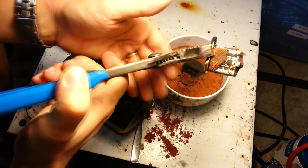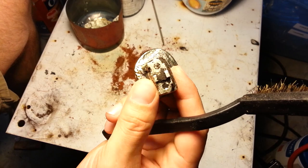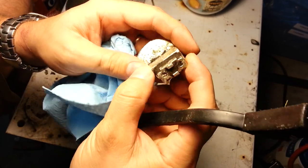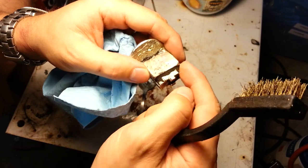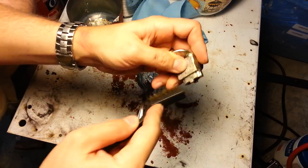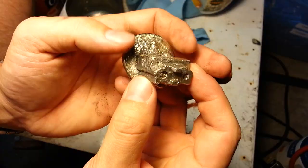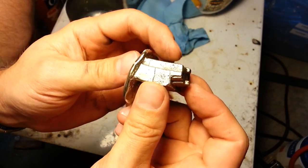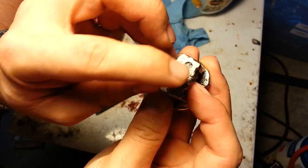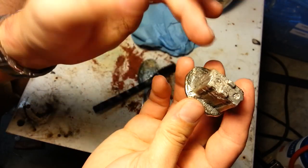It's a little bad, it's not perfect — but the thing actually looks pretty good. Not too many unacceptable voids. A little bit of crap there from some sand that stuck to the original part on its way out — that's a non-critical dimension anyway, so it doesn't matter. Really the face of this thing and this area right here is what matters. We'll take a brass brush and brush that garbage out of there. Cleans up nice. Little rough, but I think it'll get the job done. Dimensions look good — these little tabs formed very nicely. These little holes will be nice guides when we do drilling and tapping. We'll need to get a metric tap to match the screw pitch on there already, or new screws.